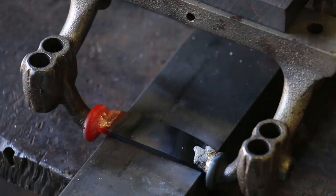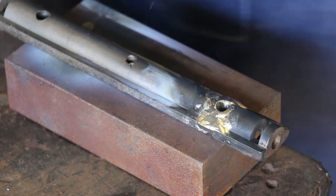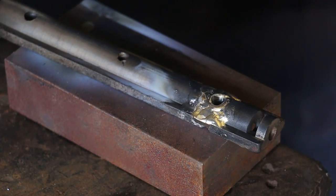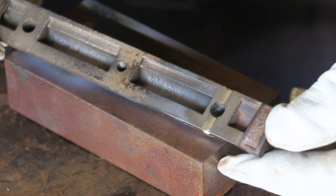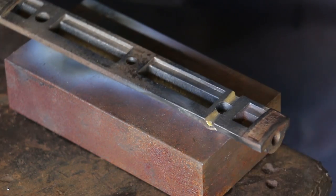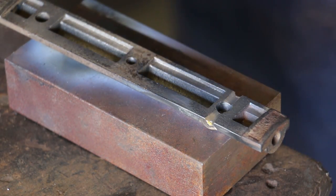All right, we'll let that cool down. We've let this first piece cool down now, and I went ahead and cleaned it up a little bit on the wire wheel, and we flipped it over, and on the break on the bottom, we just ground a V in there. I just did that on the grinder, just using a grindstone. I could have used a die grinder, but now I want to come in here and actually put some braze in the bottom of this, and that will hopefully give it some more strength, and we'll be through with this